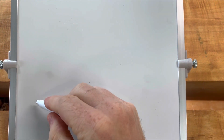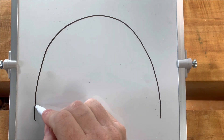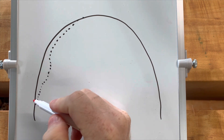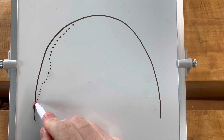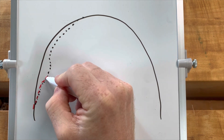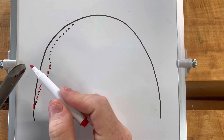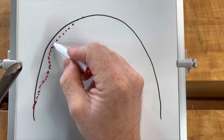Let me show this with a bowl blank. Let's say we want to come in and make a particular shape. We take our gouge, and our bevel starts right here riding the bevel, then cut in with support, and chase that. Our bevel is going to be following the contour — you're always going to have to be turning the tool handle to maintain bevel support. The back of the tool is riding on what you just previously cut.